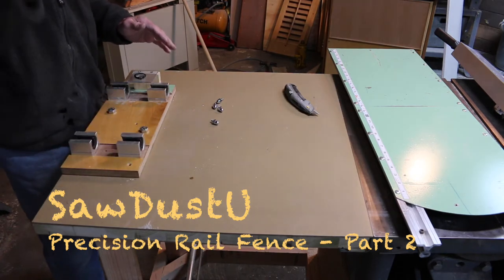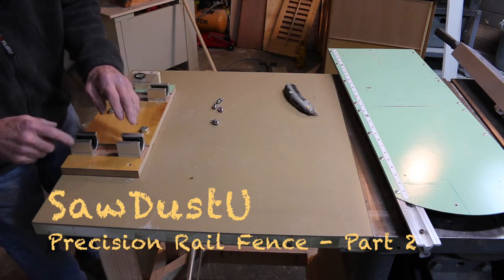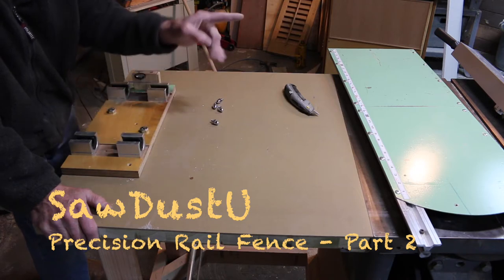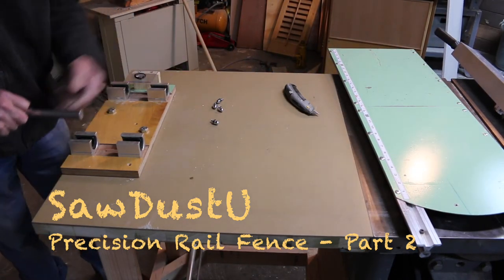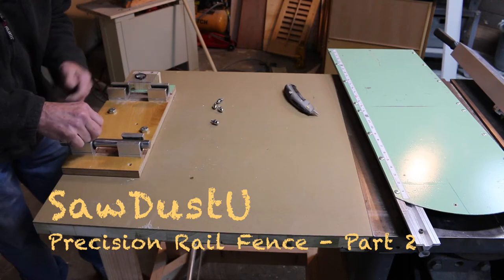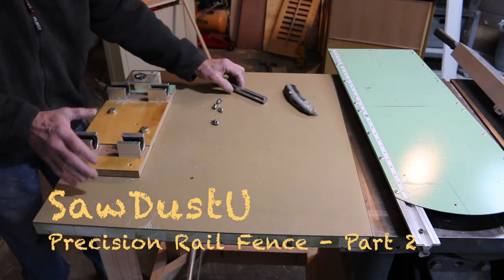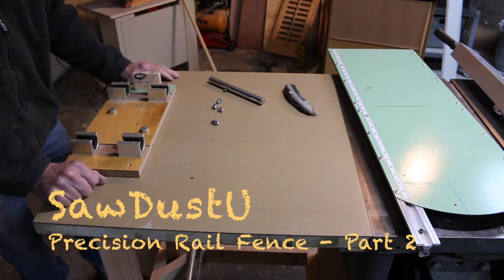Press your marks down, get your dimples, take it over to your drill press, drill your four holes for each one. These guide blocks also have adjustment screws — one on the bottom and one on the side — that you can use to tighten the hardened steel tube that the rail slides in. When first setting it up, put a rail through and check how it feels — you want no play, but don't crank down too hard either. You want it just snug so it kisses the rail and has total control. Once adjusted, put a little slow-curing lock thread on the screws, tighten them down, let them dry and lock in place — and you're good to go.